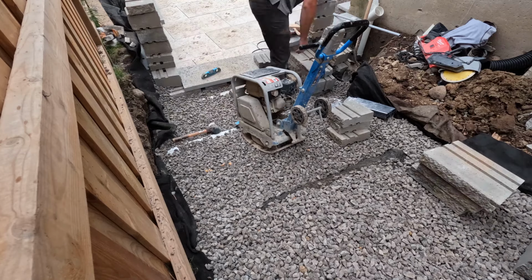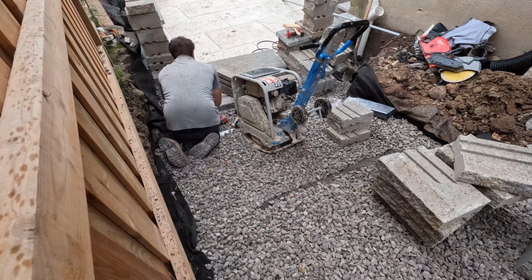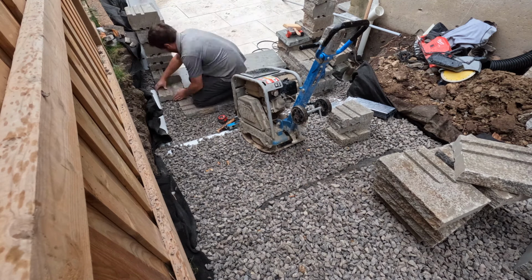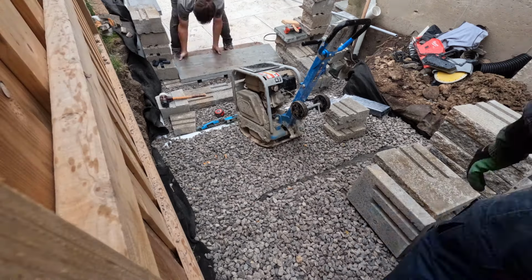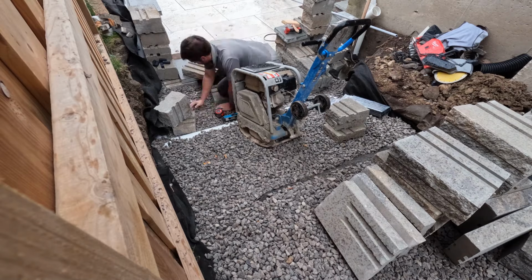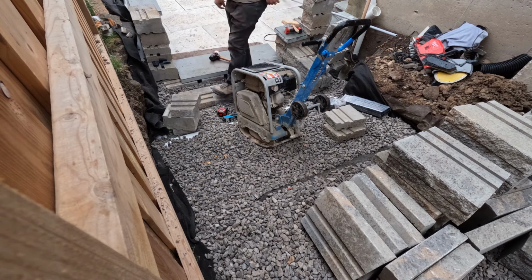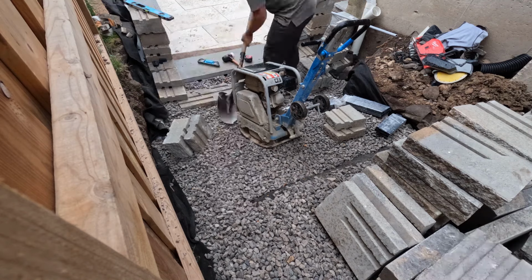Go above and beyond. Let's pause a moment here just to explain what I'm talking about. With this wall block, we have 2 different sizes. We're mixing them together. We have a 3-inch and a 6-inch, and you can combine 2 of the 3-inch to make a 6-inch. And then we have a 2-inch natural stone cap that's going to go on top to cap these steps. So when I say we go 3, 6, and then 2, we start with a 3-inch wall block, we put a 6-inch on top, and then we add a 2-inch cap. Now that would give us an 11-inch step, but 5 inches of that is going to be below grade. It won't show. So that's what I'm talking about when I say 3, 6, and then 2.